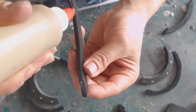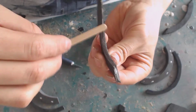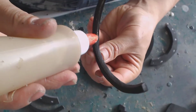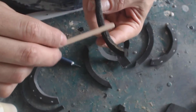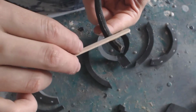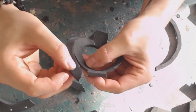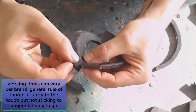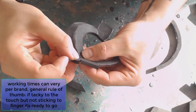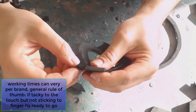Now how contact glue works is like this. Apply glue on both parts that need to be bonded together. Wait for about 10 to 15 minutes and make them contact. Apply pressure and it's stuck together forever. Sharp glue lines, no burns, but it does smell a bit chemically, so use in a well-ventilated area.